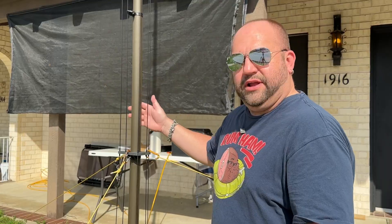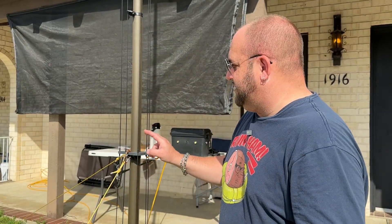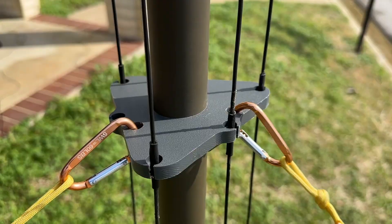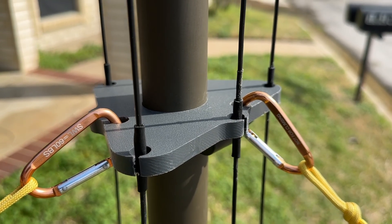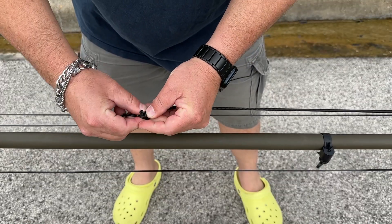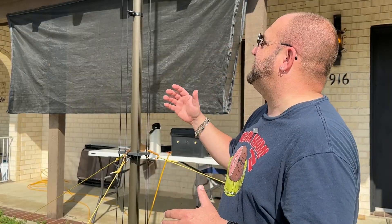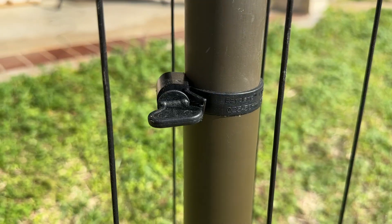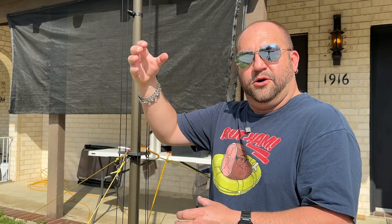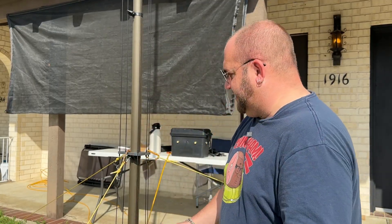We've got this nice greenish mast that is very stealth when you're out in the wild. The spreader plates are a lot more thick and more robust. They've got slots for the antenna wire to go in, as opposed to having it fed through. There are no more clips. We just put a knot in the doingy and through the loop in the wire we're able to attach the elements a lot easier. And you've got these awesome plastic jubilee clips that you put over each element to prevent it from wanting to collapse down on itself, especially on windy days.